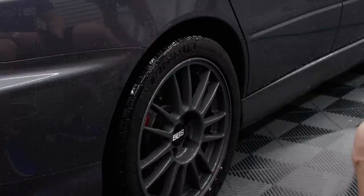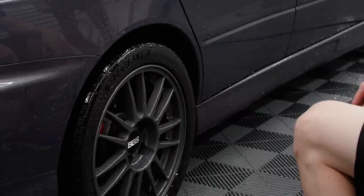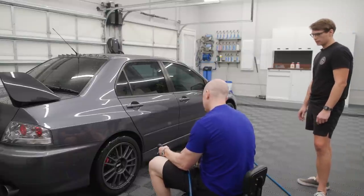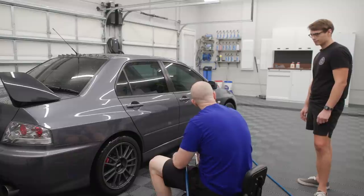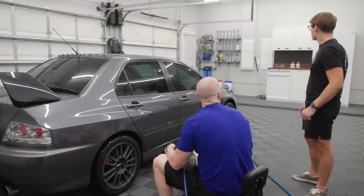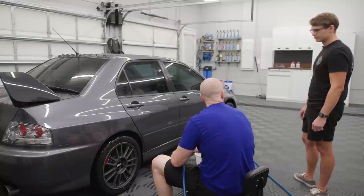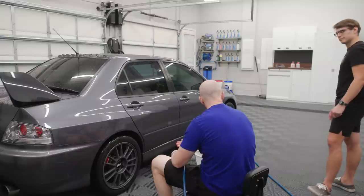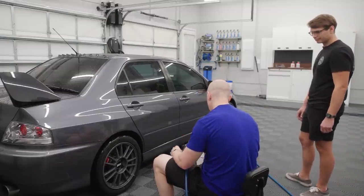So you can see, we're moving some water, but, you know, it's 1,000 PSI. And there's no kick. Really? So I showed in the video yesterday, when I use the KWS, the big boy, the 20 millimeter pump, you could do roughly 3 and change gallons a minute on a single machine easily. You could do 5-10 gallons a minute on a single machine, especially if you have the power for it. But the problem is those will hold more inline pressure. And so right now we're only holding 1,000 PSI or so.